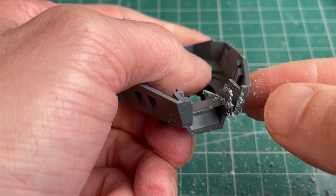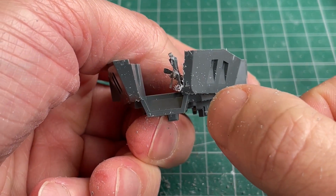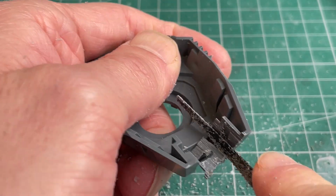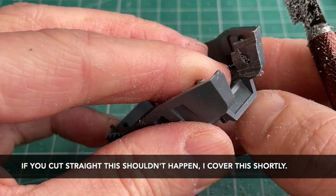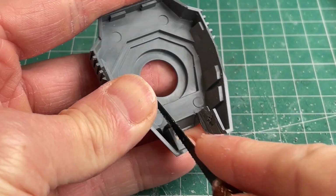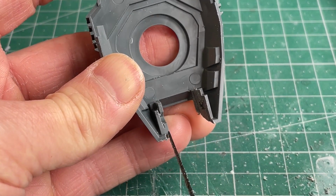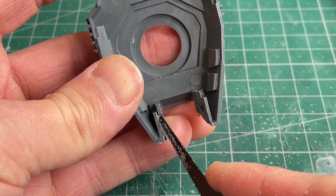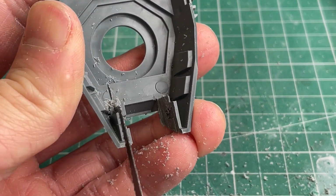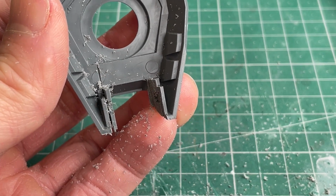As you're cutting, you just want to make sure that this is as vertical as possible, really, to keep it nice and neat, but we can tidy it up afterwards. So that's come away. So just repeating the same thing on the other side, having our blade flat up against that notch. So again, you can see how it cuts straight down, in line with where that notch is there. And now once you're effectively hitting into this, you know you can stop because you've gone down far enough.